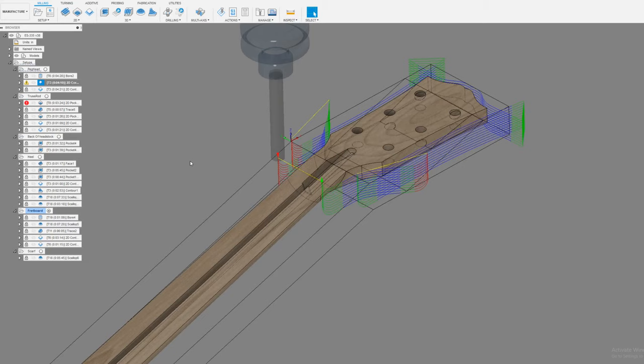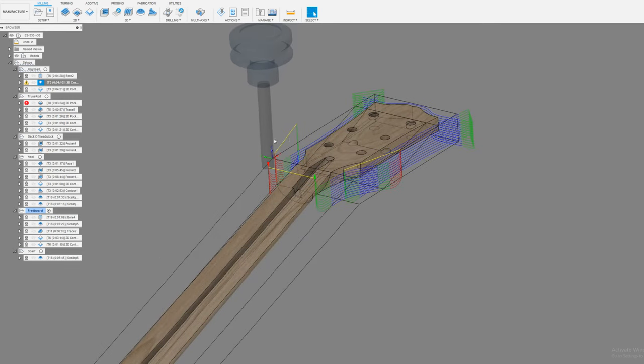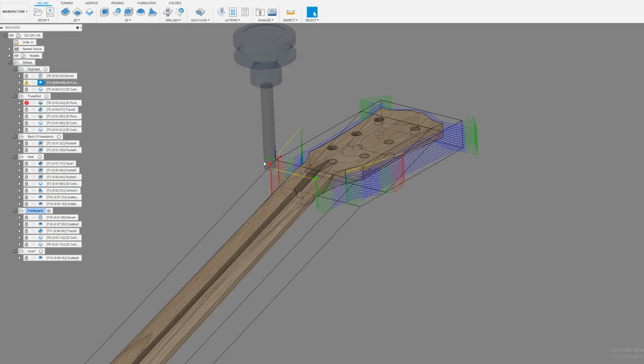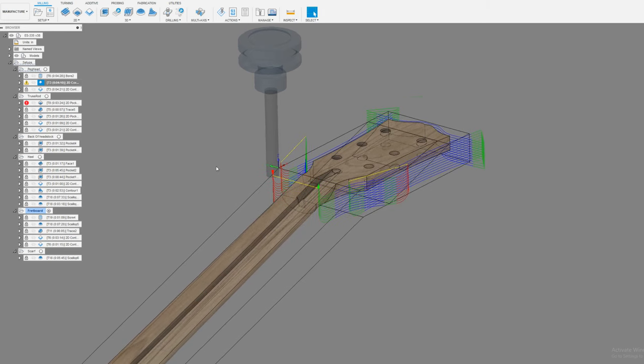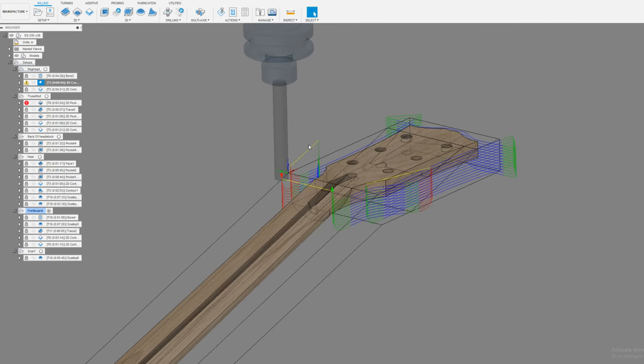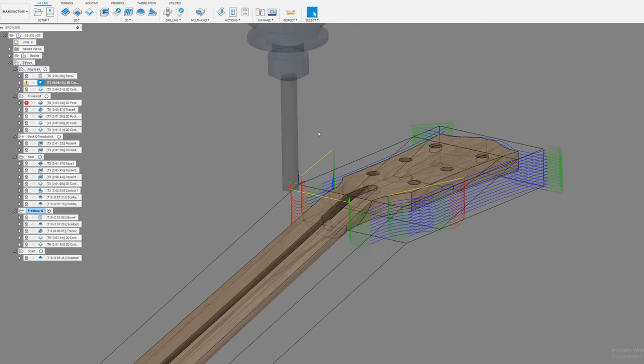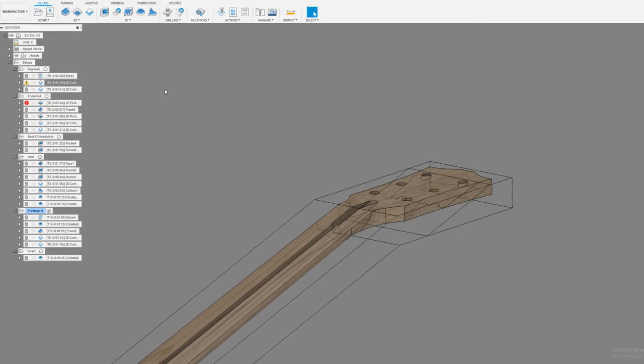Anyways, it does affect the flex. To put it in perspective, this is a half inch bit that's 3 inches long, and I use this for deep cutting. I got a whole bunch of these for a really good deal. It's just a straight flute, and that seems like a nice long rigid tool, but there's quite a bit of flex in those. Any tool that's spinning on a router is kind of like a rubber band on a small scale. Steel is quite flexible, even carbide. So anyways, let's keep on moving.